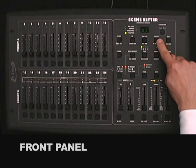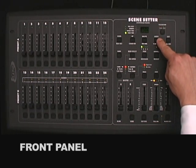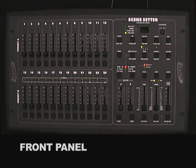The insert, % or 0 to 255 setting. This is also a multi-function button. The insert function is used to add an additional step or steps when in chase edit mode. The % or 0 to 255 function is used when selecting a desired display reading. Setting to % will display values from 0 to 100% in the display. Setting 0 to 255 will display in DMX values in the display.